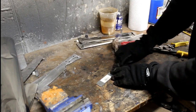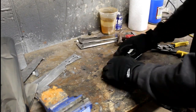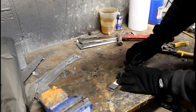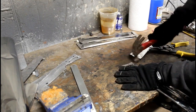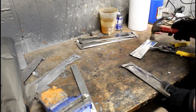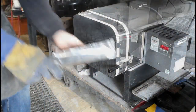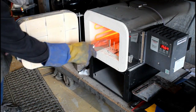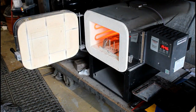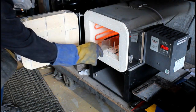You're going to want to wrap the knives in tool wrap and create as airtight as possible envelopes by double folding each one of the seams before placing them into the heat treating oven. Tool wrap comes in two different sizes or thicknesses. For our blanks you can use the 321, which is good up to 2,000 degrees. AEBL stainless gets heat treated up to 1,950 degrees, and then there's a hold time — you have to hold it at that temperature for about 15 minutes.